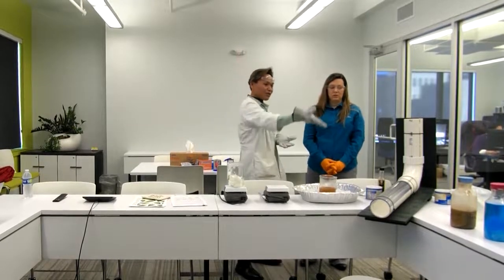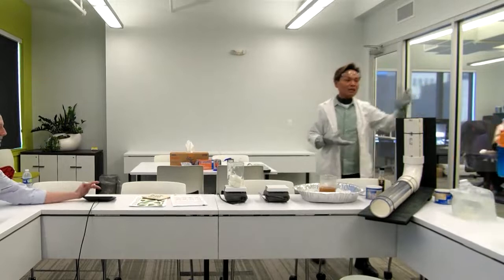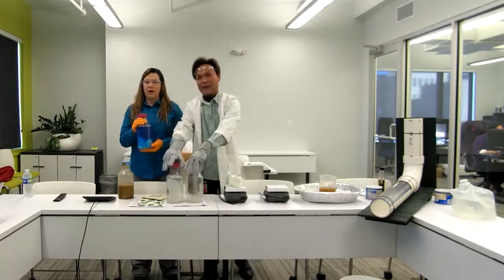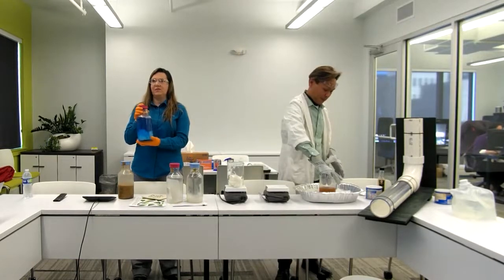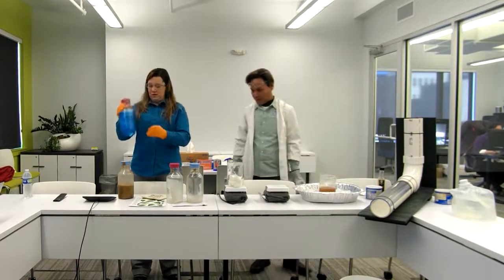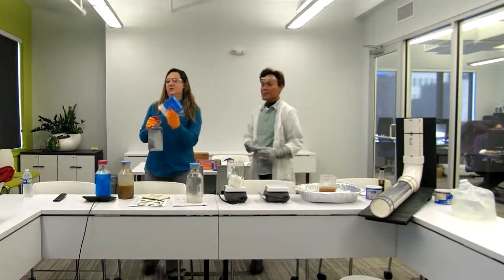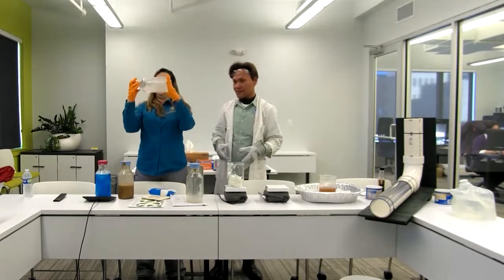We also have some simulated experiments. These are items you should never put down your drain, whether it be your toilet or your sink. These are scrubbing bubbles — flushable wipes. They're used to scrub your toilet bowl and they're advertised as flushable. But as you can see, this has been in here for five years and it has not broken down. You can still see the flushable wipe in the middle of it. This is a sanitary wipe also advertised as flushable — it has also been in here for five years and does not break down at all. You can see the whole wipe in there.